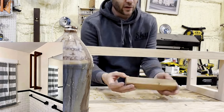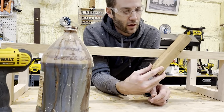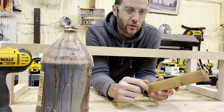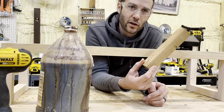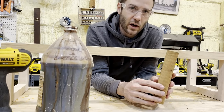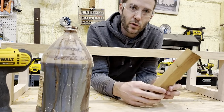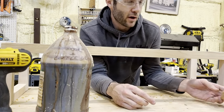After it gets done and sits for a little while, it will kind of have this patinaed look — it makes it a little darker. This is on pine wood. This finish works differently on different types of wood; if I use this on cherry, it almost turns it a real dark gray or black. Using it on pine, it doesn't appear to change it that much, but it does give it a little darker, more antique-y color. It does change a little over time, so when you first put it on, keep in mind it may take a little while to reach its full potential. I'm going to go ahead and put that on this one — I think it'll look kind of cool with a more antique-y, original look for our farmhouse style.